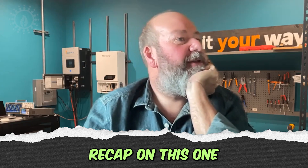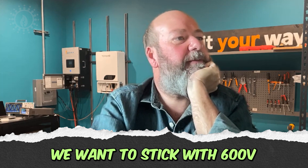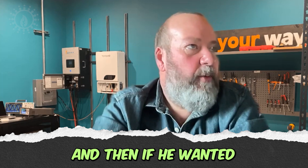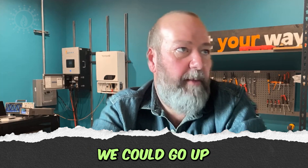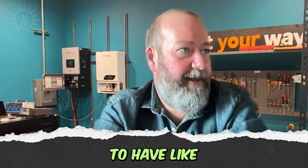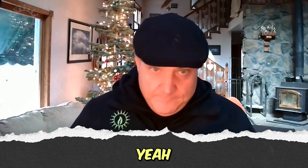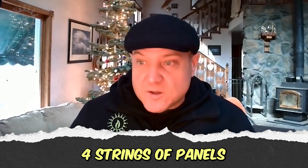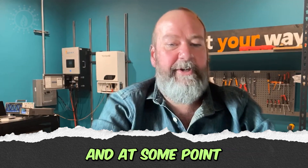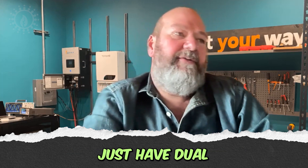Just a quick recap: because the voltage can get over 300 volts, we want to stick with 600 volts. We've got four poles at 20 amps, and if he wanted to leave room for expandability, we could go up to an eight-pole before it gets too crazy. Four strings of panels is eight poles that need to be disconnected. At some point you'd get into too big of a pipe run, so it would make sense to just have dual disconnects.